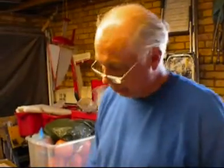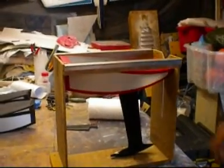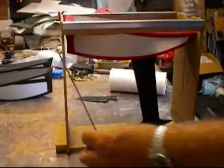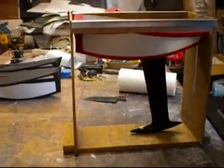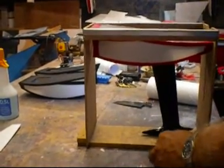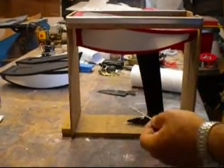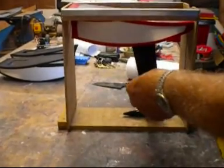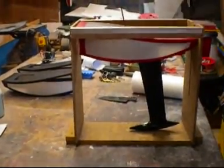Okay, we're at a tricky point now. We've got my measuring box for foils, and as you can see it's got open size, and we've got the hole we've just made, and we've got one of Roger's fins already in. It's not glued, and as you can see he draws it so that the bow and the transom are parallel in the box, and therefore the fin is angled way back. There are two marks here that we always use to line up the bottom of the fin. So basically, when it's in the water, it doesn't sit like that; it sits on the waterline just here and just here. It has a lot of rocker, and this then becomes more vertical, but still slightly back. So if we put the mast in now, you'll see it sticks forward quite a long way.